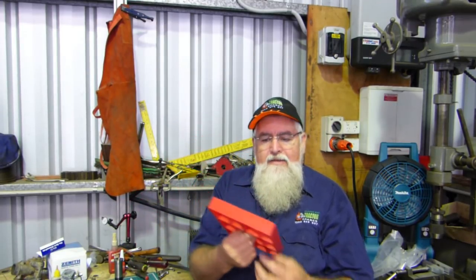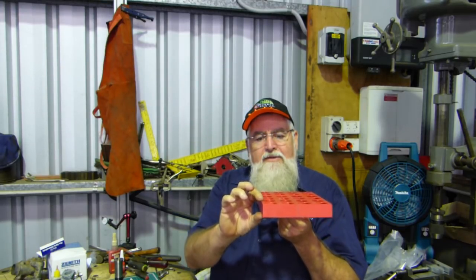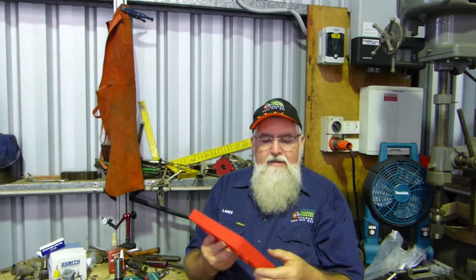I finished the design early in the week then didn't have time to come up to the shed and actually sit it in the toolbox and check depths and heights, because this is 30mm on the side here. I've had to check that if I open these holes up and make it bigger for the ER40 with the 30mm side, whether the 40s will fit in a 50mm drawer alright. If it's all looking good I'll fill that up with my collets shortly in those new toolboxes and do a bit of show and tell.